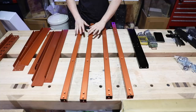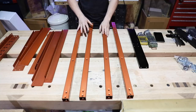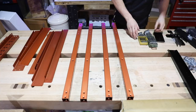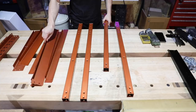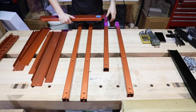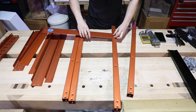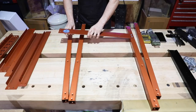It's worth saying that the legs are the same on all four faces, so it's a bit more difficult to get this wrong as opposed to Ikea furniture, but we'll see if I manage to prove myself wrong today while on camera. On the ends here we've got some tapped holes. A lot of people would think these would go on the inside, however these actually go on the outside. The stretchers overhang it and then you throw a bolt through there. I'm going to do them up very loose for the time being so we've got plenty of opportunity to move stuff around and get holes lined up.